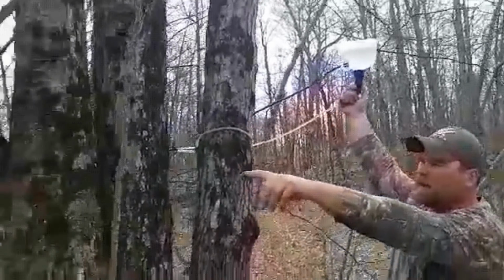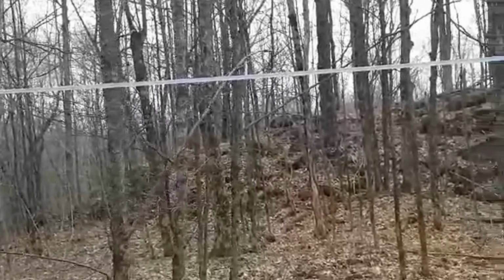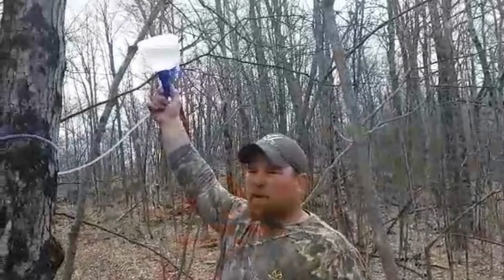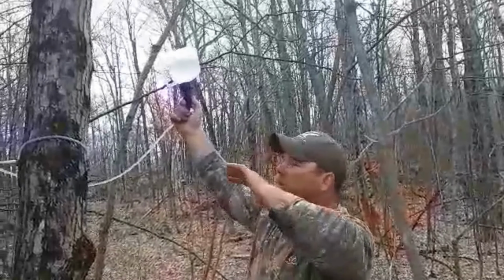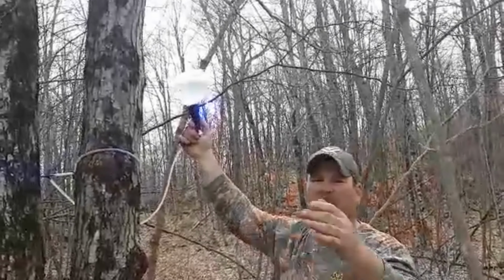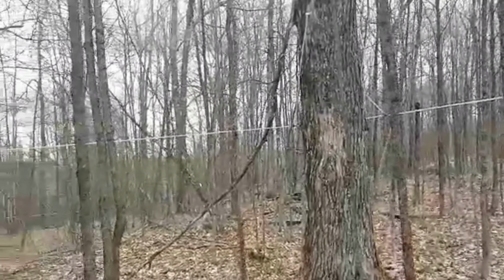You can see the water running through the line there. You can see the bubbles going as they're running through. I don't put a lot through, I put a bit through, just enough to get whatever little bit of debris in there. And all these lines run to a main line. So I'll run all this water through, and then I'll run my isopropyl through the drops. And then once this whole line is done, I come back up and I pump about 20 to 30 gallons of water through the main line to wash the main line out and whatever's left in it.